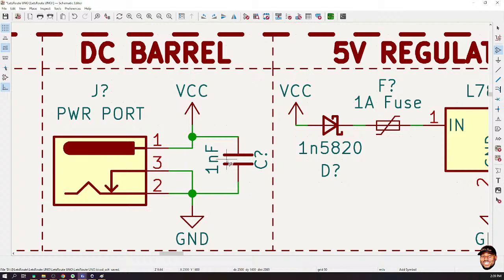Usually, the way ferrite beads operate is when we have transients, its properties, like resistance, vary with varying voltage and electromagnetic noise. Exactly. But all these things can be avoided through proper PCB route management. Don't worry, when we get to the PCB design session, I'll talk about some of these things. Usually, when I'm working with an IC and the application note has ferrite beads in there, I strip them off and just ensure proper PCB design. That's all.